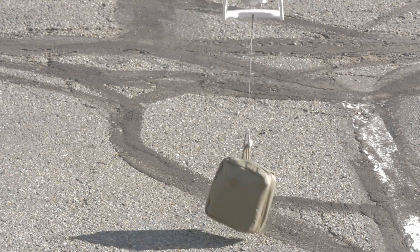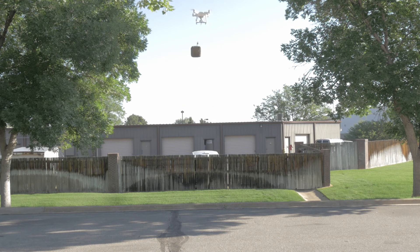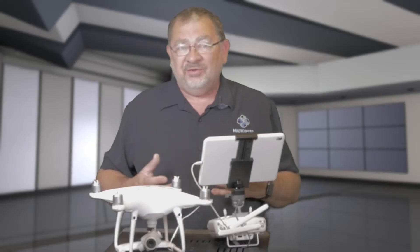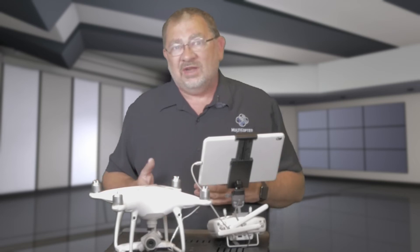One thing people are going to ask is how much weight it can carry, and it's a difficult question to answer. The Phantom 4 was never designed as a payload delivery copter, so it's not really designed to haul pounds of weight. What you can actually do is going to be dependent on your environment. Here where I'm filming in our office, we're at about 5,800 feet above sea level, it's very dry and very hot today with no humidity. So we're going to have an altitude density of probably close to 8,500 to 8,800 feet, which puts a lot of work on a Phantom in general, let alone carrying a load.